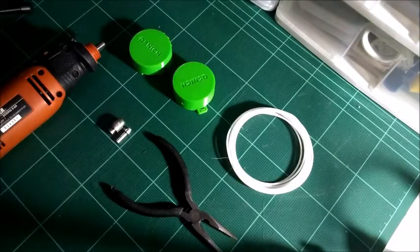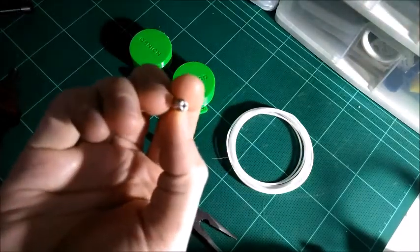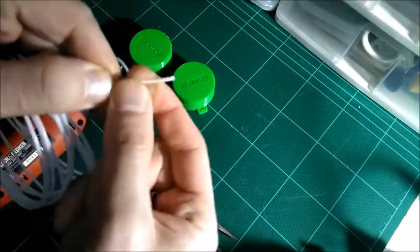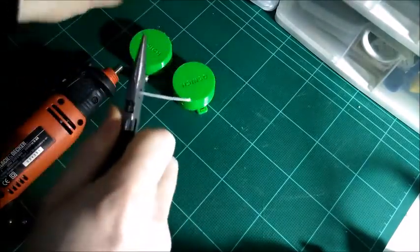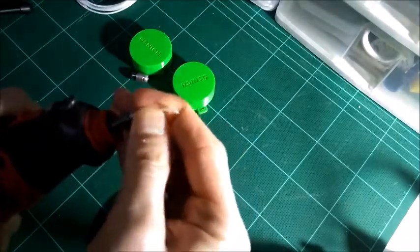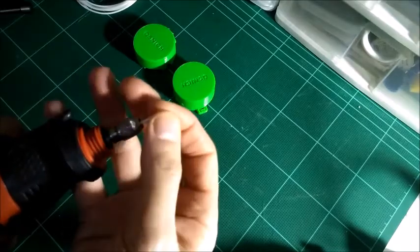I'm going to show you how I do friction welding. Right here you can see we've got an ordinary rotary tool — they come with these collets. This is a pretty small one, this is for accommodating the 1.75 millimeter filament. What you do is get a little bit of a length of filament, clip it off with some pliers or cutters, put the collet in first, work that filament in there, and then put this retainer on.